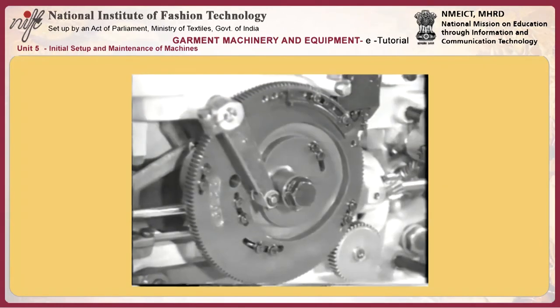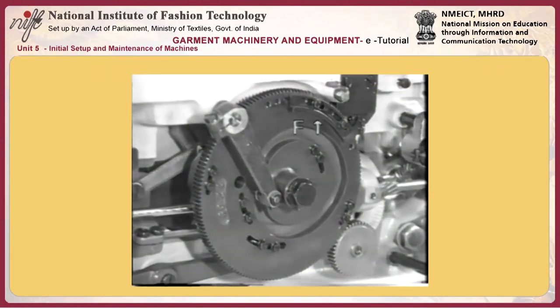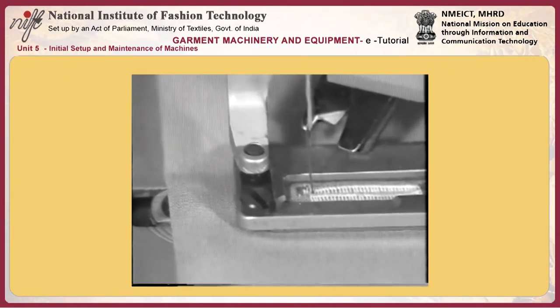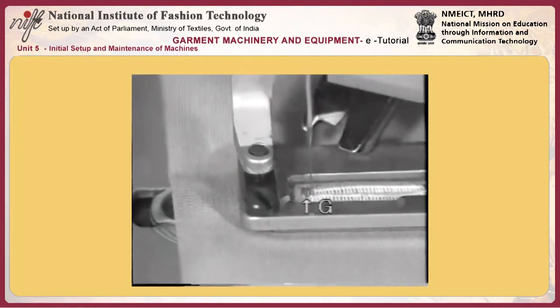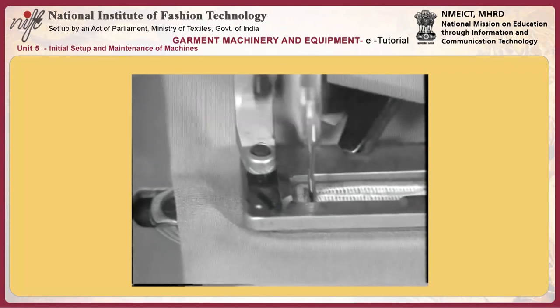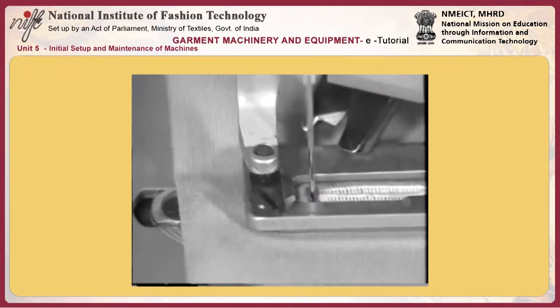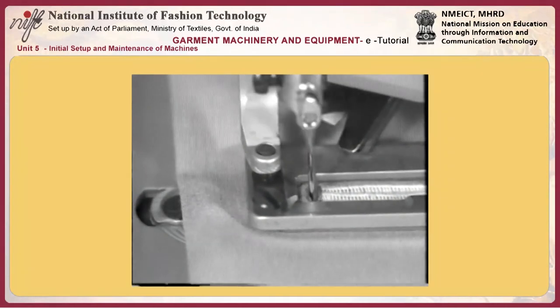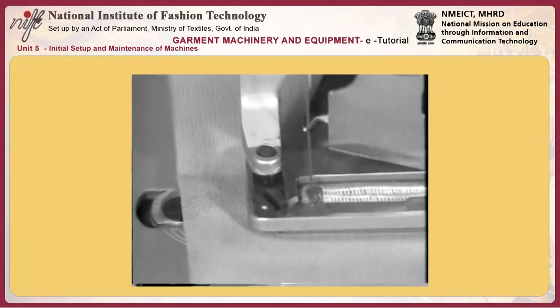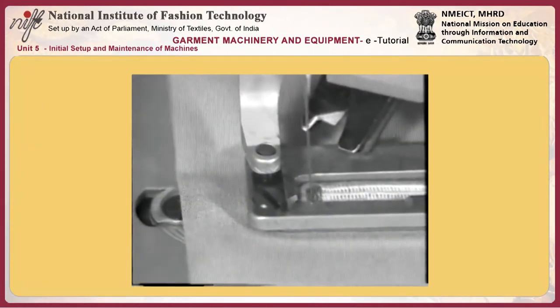Turn on the power switch. Turn the sewing machine until the stop motion position is reached. Now, adjust the position of stop motion cam F so that roller E meets marker line D engraved on the feed cam. The machine should stop in second bar tacking section G, when it has produced two or three stitches in the parallel side section after the completion of bar tacking in which the needle swings widely.